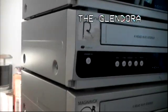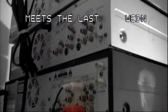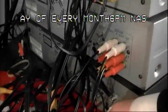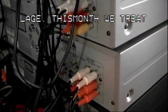That's me, Gregory, at the vegetarian supper. Over here, the recorders are all labeled — previously labeled with letters: O, R, Q, and up the list. We've gone through a lot of DVD recorders. They're all wired up in series from one to the next. The signal comes in here, goes out to the titler, comes out of the titler, and goes back into the recorder. We can make a number of copies of each program this way.